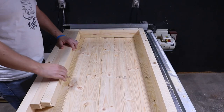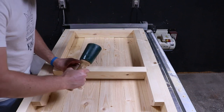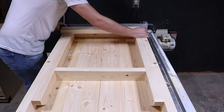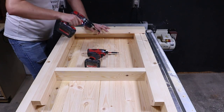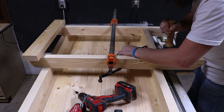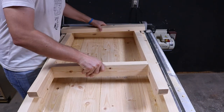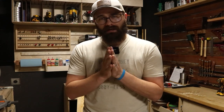To make the legs, I cut my 1.5 by 3-inch boards down to 36 inches, cut my little angles, and set them in place where the bottom of the leg hits the bottom of the apron. Once they're in place, I added a bottom support for the legs and screwed it into place. I then took the legs out, laid everything down, and set the inside brace to go between each leg. The bottom foot brace is 24 inches long — the same width as the backboard and apron frame. The inside leg support is 17 and three-quarter inches long, which turned out to be just perfect.